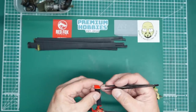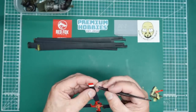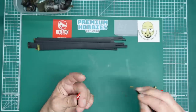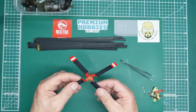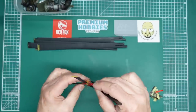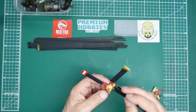This is one of the problems — masking tape tends to go into super-sticky mode and will absolutely weld itself in, you won't get it off and it'll start peeling paint and leaving glue deposits. It's really best if you can get the masking tape off within 24 hours. When it's on top of paint like this, try to get it off within 24 to 48 hours.